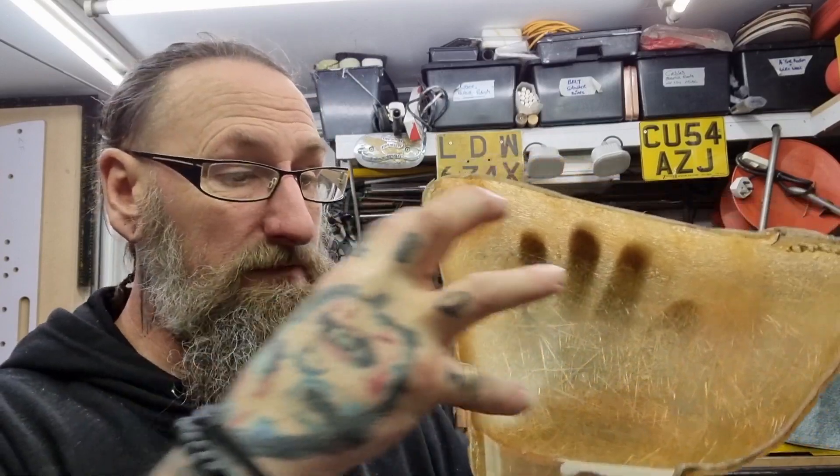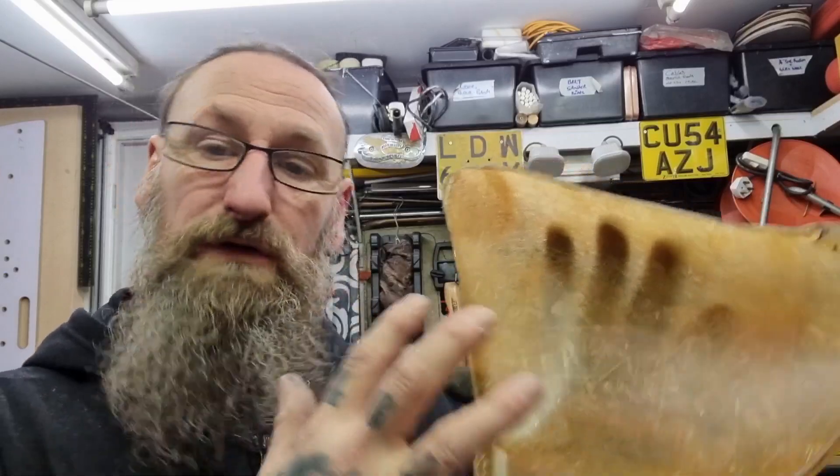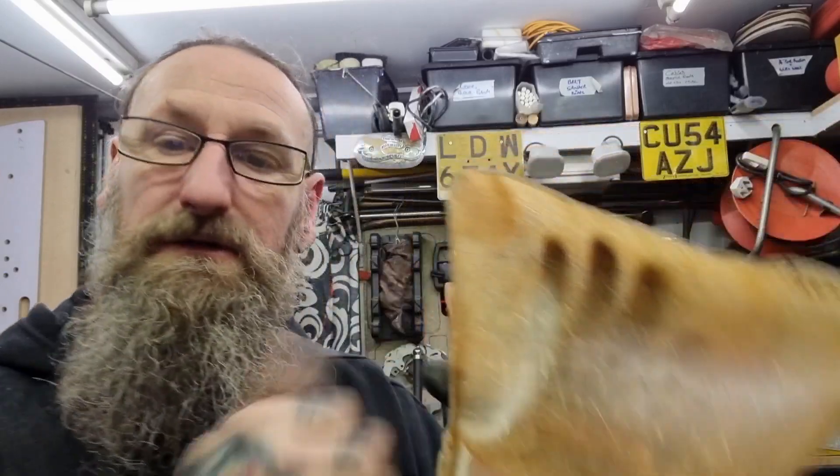The outside should be nice and smooth and shiny, the inside will be a little bit rough with fiberglass but I'm not bothered since it's inside. I'll do the same again, stick it on a tripod, skim through, maybe put a bit of music on. So resin then fiberglass, leave it overnight like I did last time, come back and we'll do a pull and have a reveal. I'll clean it up and give it a paint — I won't show fitting it yet, but let's mold it.